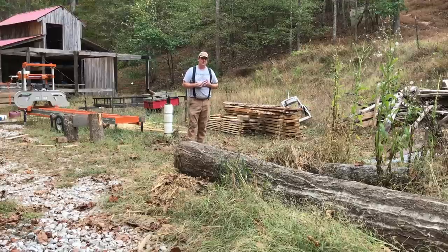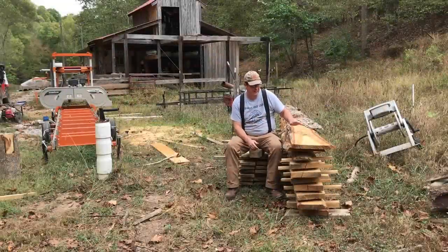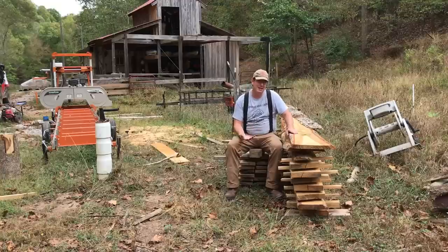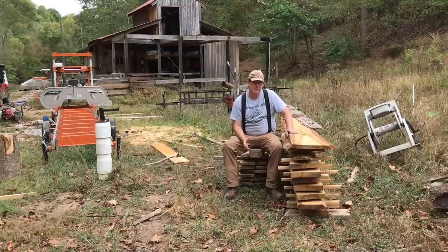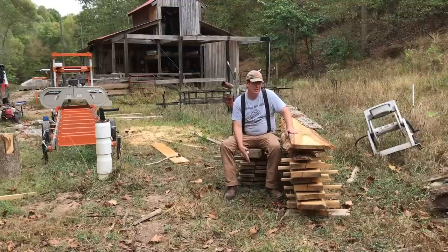That moisture has to come out to be used in finished woodworking projects. The amount of drying needed before a board can be considered useful obviously varies by project. This white oak is going to be the deck of a utility trailer, so I've got it stacked up to air dry — it doesn't have to be as dry as woodworking wood since it'll be outside. Here's poplar I've milled recently for our farrowing barn — I could actually put it up green, though there are issues of movement and shrinkage. I've got it ricked up so by the time I'm ready it'll be plenty dry.